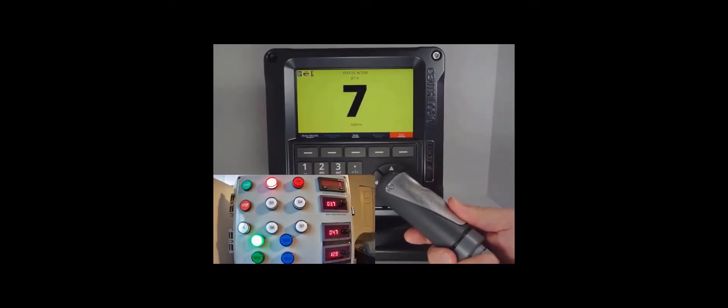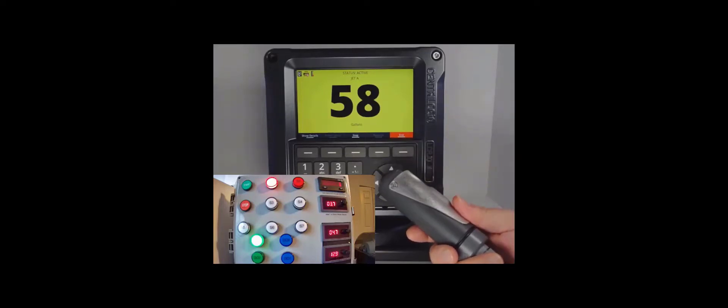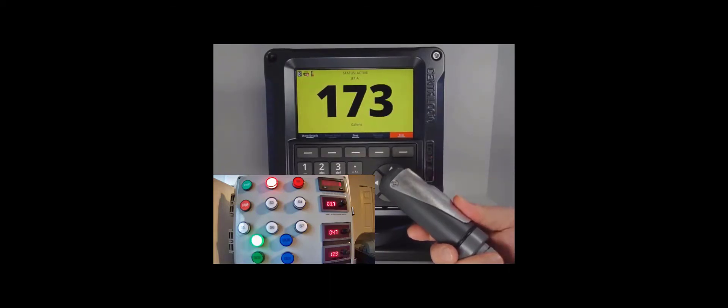Now if I grab my Deadman and trigger the handle, you'll see flow will start — my primary flow control S1 is illuminated red, and my Digital Output 1 for my Deadman indicator is lit up green. If I release the handle, S1 will close the primary flow and Digital Output 1 will shut off, so the delivery is paused. If I re-trigger the handle, flow will continue. Now if you remember, I reset the warning timer to 15 seconds. So if I leave the handle engaged for 15 seconds, once the timer expires, Digital Output 1 will start to flash as programmed, and Digital Output 2 is also engaging my buzzer. If I re-toggle the Deadman handle, the timer is reset and flow continues.